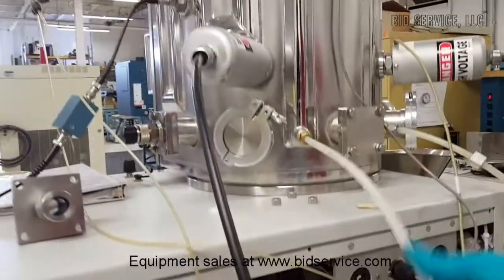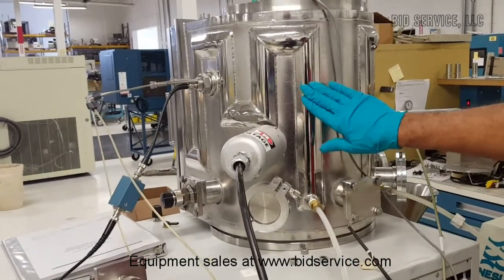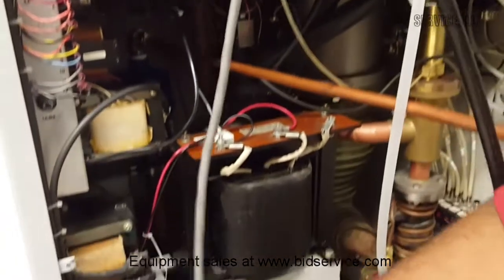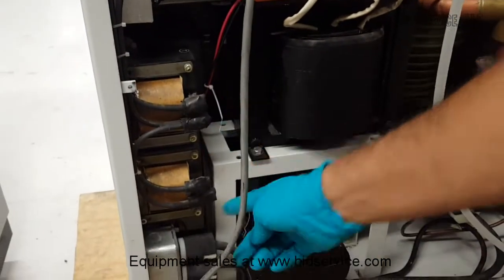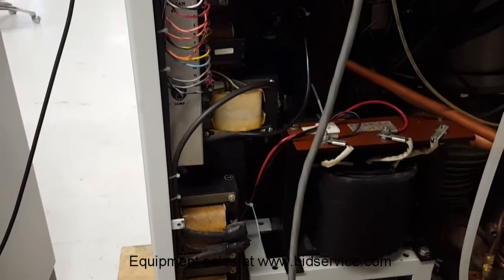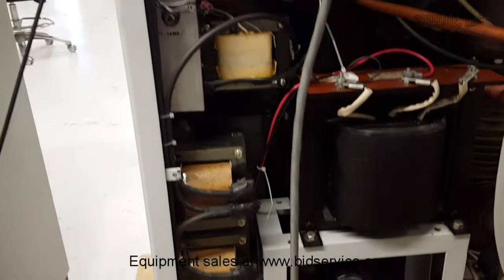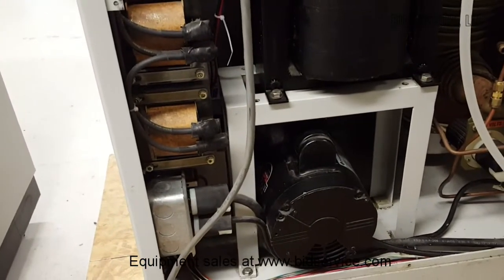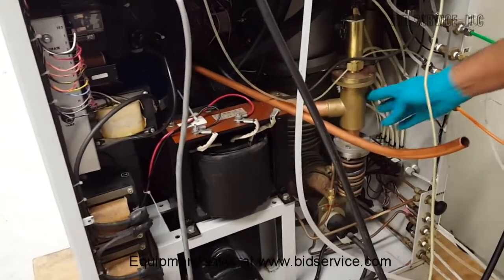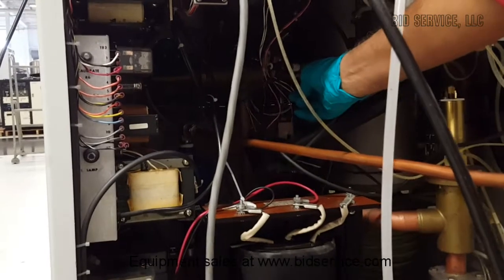I also have connections available for the chamber water cooling lines. This one is the 2kVA transformer, and there are two 1kVA transformers. Each filament is powered separately from its own transformer. This one is the controller module for the cold cathode sensor — the high vacuum gauge. And there is an Alcatel 2010 mechanical pump here. I have removed the back panel grid to show all the ports. This is the backing valve and the roughing valve. The other valves are inside the system.